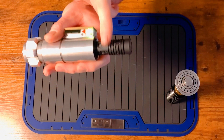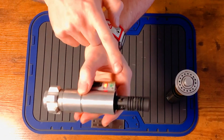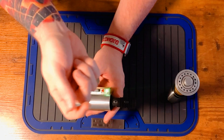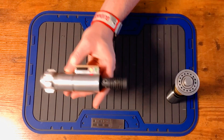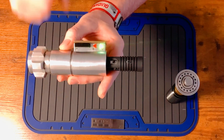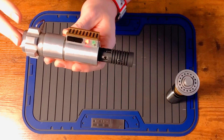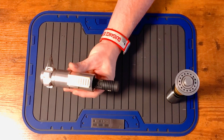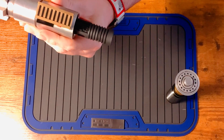This is where you charge your battery and also how you get to your board. One thing I do want to mention to the customer: if you are uploading your config or data through this USB-C port, make sure you are ejecting it when you are finished. Don't just pull out your USB cord from your PC. Some of you old school Windows users will know what I'm talking about. I have found that if you just yank the cord out when you're done, it can cause corruption issues with the SD card. If that happens, you'll have to unwire the entire control box, pull the chassis out, and reformat the SD card. I always eject the USB drive when I'm done — just right click it on your Windows machine and click eject.